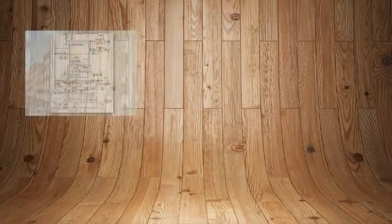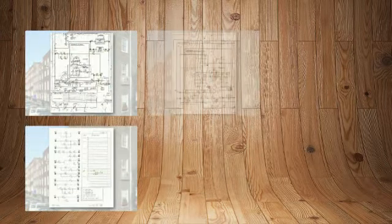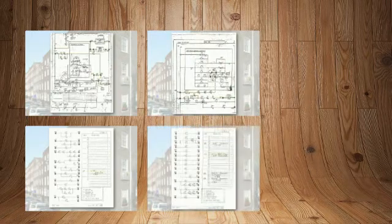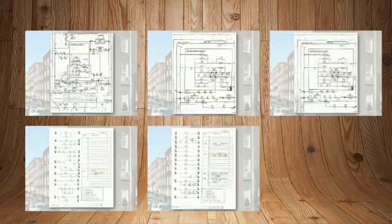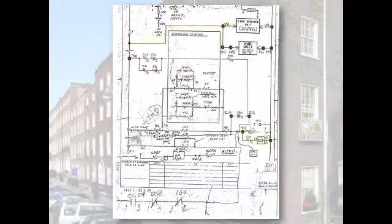Now, what we recommend is this. Before you begin the job, take these ponies, lay them out on a nice table. Also, lay out your prints and go through them terminal by terminal, from the pony to the print, and highlight everything. Once you've highlighted it, it's going to become really clear. Now notice here, and this is why we want you to highlight it. No place in the pony are we telling you to make this connection or make this break in the system.